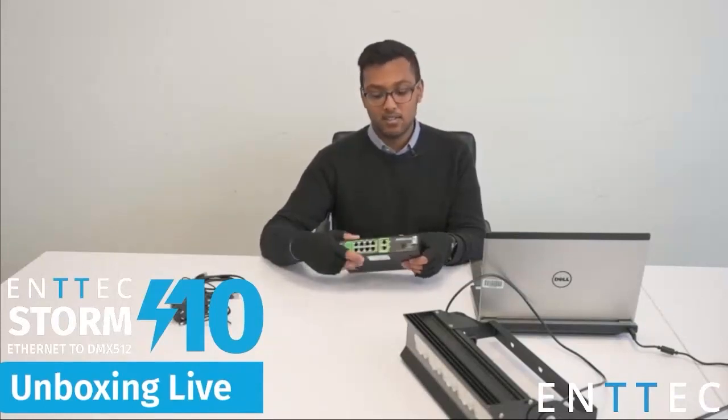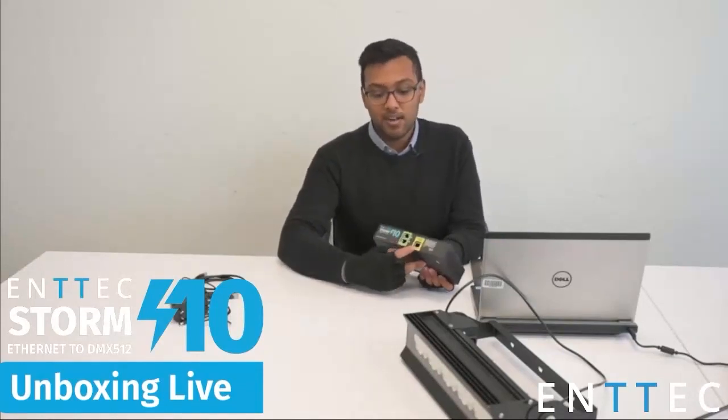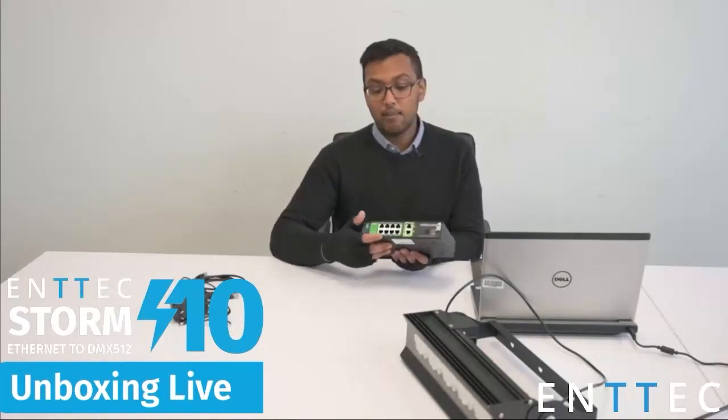Question: What's with the Ethernet ports on the back? So a common misconception — these are RJ45 ports, but they're not necessarily Ethernet. We're using these to transmit DMX data. Looking at the front, this RJ45 port is Ethernet — it's connecting us to the network and is labeled as such with a yellow halo. Whereas all of our DMX ports have green color coding and are outputting DMX. They have the same shape and port type as Ethernet, but they are actually being used to transmit DMX.